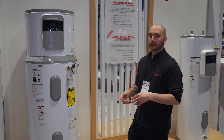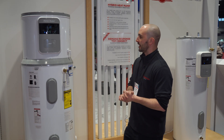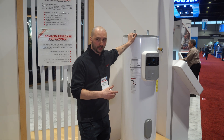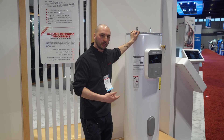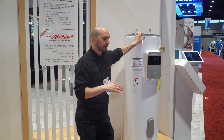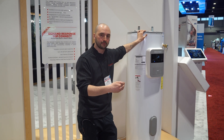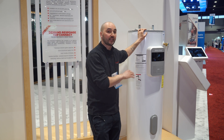We also sell an accessory shutoff valve for the inlet — if it senses a leak, it turns the water heater off and sends a notification to the end user. Over here, electrification is a big trend and many parts of the country are doing demand response programs, so this is our demand response electric water heater. It's a standard electric unit with 4500-watt heating elements, electronic controls, and that same iMemory feature. It also has EcoPort, so utilities can control your water heater — turning it off during on-peak hours and back on during off-peak to save money for the homeowner. It comes with an ultra thick, durable glass-lined tank and a six-year tank and parts warranty.